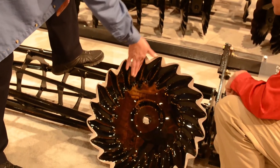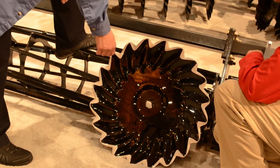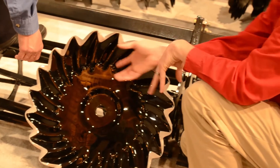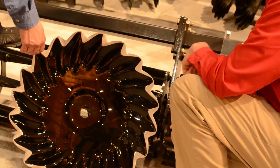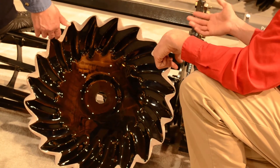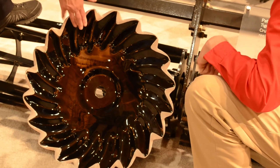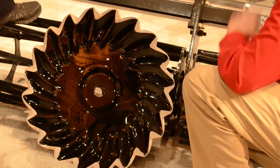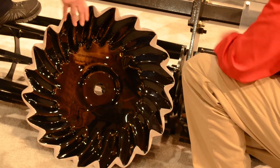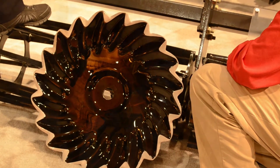It continues the tradition of a crimp center, which gives a solid place for those spools to mate up — when you tighten that gang down it's always tight and stays that way throughout the life of the blade. It's also serrated, which is what makes it look so angry and mean as the Barracuda name would suggest. It's obviously a residue-cutting machine, and the serrations also extend the life of the blade. We're able to cover more acres because of the 22-inch diameter — the chisel tip wears down and then the valleys in between become the cutting edge.